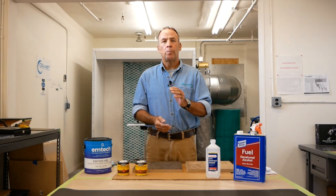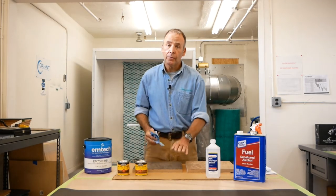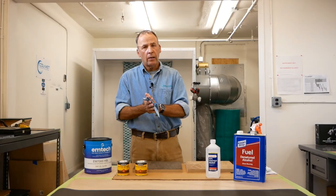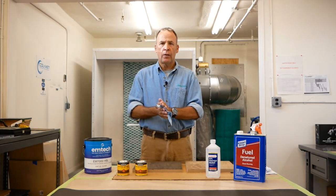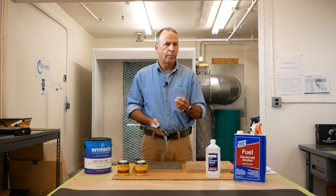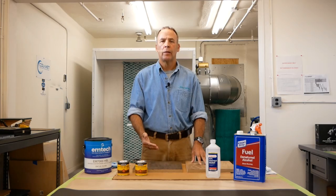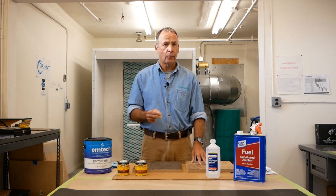Stop there. But if you do not see any of those defects, you can now wipe the first coat of the lightly misted water-based system down, again, with a solution of water and alcohol. That'll melt the water-based clear coat or sanding sealer again into the solvent-based stain. It's going to melt it all together. From here, you can then apply your first fuller, bigger coat, 2 to 3 mils wet per coat of the finish of choice onto the prepared substrate, and you can proceed from there. So it is a very simple process, but it's important that you follow these steps for a successful finish.